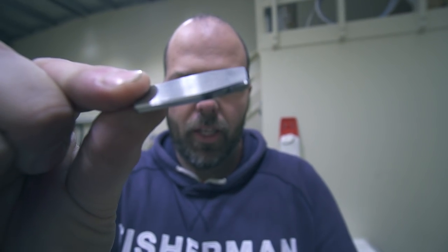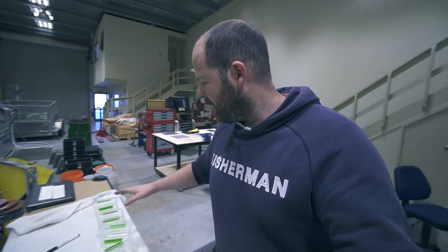It is 3.52. Now that's only 0.1 of a millimeter, but when it comes to the chamfer on these — hopefully you can see that little chamfer on the edge — 0.1 of a millimeter is noticeable. You will see a difference between one or the other. So I've got to arrange these into different thicknesses and then for each of those on the CNC program, I've got to run a different program depending on the thickness of the blank we put in.